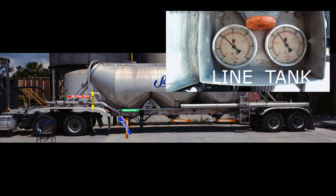There may be a switch or control panel by the silo pipe, or against the wall, near the silo, that you have to turn on. Sometimes it's labeled baghouse or dust collector. Just ask the customer if there is any switch you need to turn on before you start unloading. Some places may have a lever that pushes up on a switch when you hook up to the pipe with your hose. It may be out of adjustment, and you may need to use a bungee cord to hold the lever high enough so it can press the button.